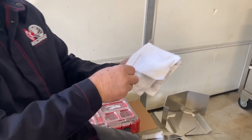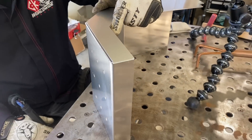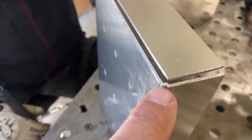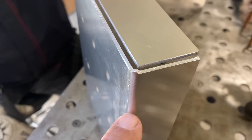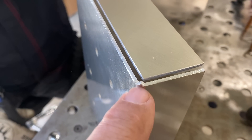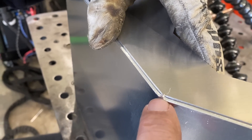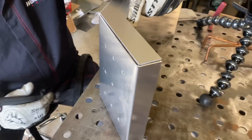Brad usually cuts out his parts on a CNC router so the edges are really clean, but he also cleans everything else - gives everything a wipe down, even the filler rod - because aluminum welds better when it's clean. Brad owns his own business and often works by himself, which means he's holding the parts with one hand and tack welding with the other. With carbon steel and stainless, tack welding without filler metal is pretty easy, but it's a little more difficult with aluminum because it wants to crack. So Brad has figured out a way to put little points at his brake lines. It gives him a way to line it up on the brake to make the bend, but also serves as filler metal to get that first tack when he's using one hand. Another benefit is it helps you line the joint up corner to corner without it overlapping and slipping off - just ease of fabrication, and it provides a little filler metal.